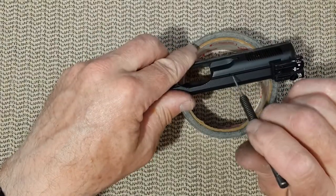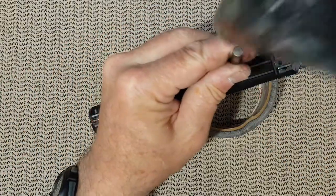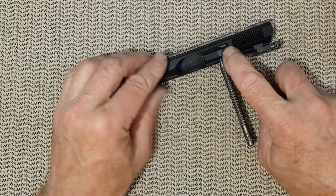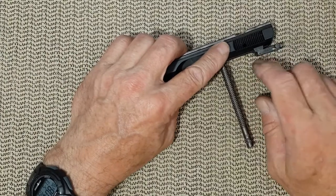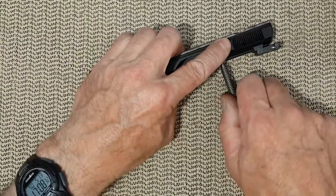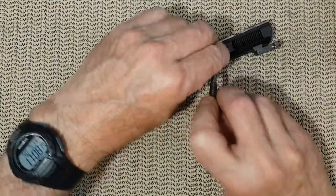You will need to extract it from the top of the gun, not from the inside. There is a spring here — there is not too much pressure but always when you have a spring, put a finger on the spring. It beats having to look all around the room for a spring. Pull the punch and here is the extractor and here is the extractor spring.